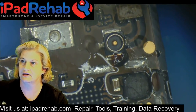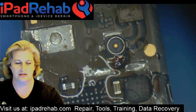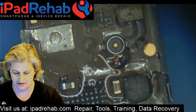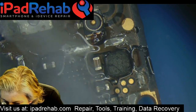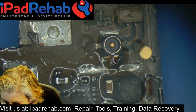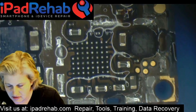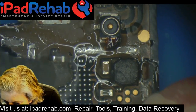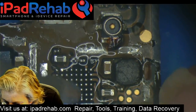All right, let's see. What do you think of conductive adhesive? Is it as good as solder? Oh, no. Never buy it, never use it, throw away any stuff that you have. That stuff is total trash. I guess conductive adhesive is better than the conductive paint. That is just a disaster waiting to happen. I don't know how many boards we've seen that are ruined with the conductive paint. Just, ugh, that's a nightmare. It's not really conductive in any way, shape, or form compared to a wire.